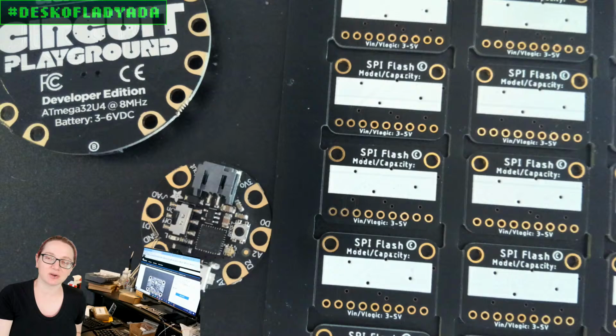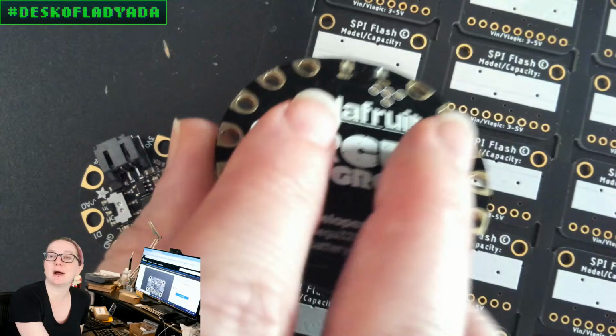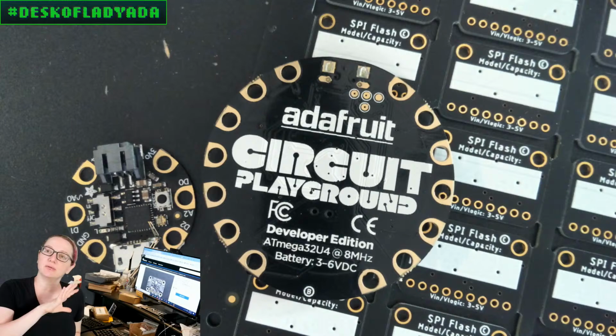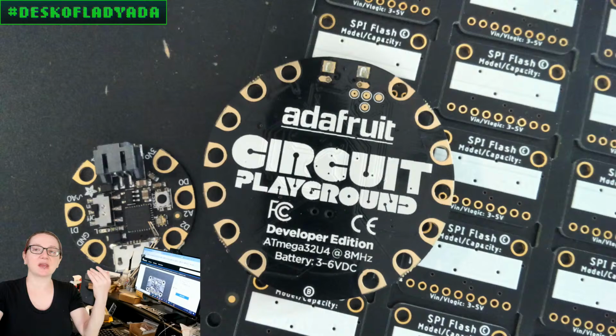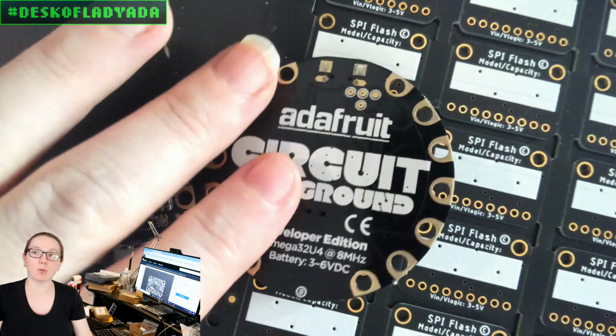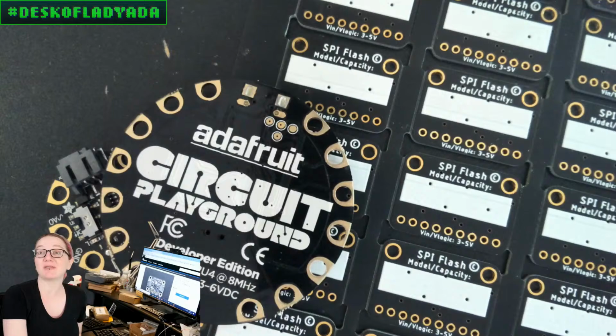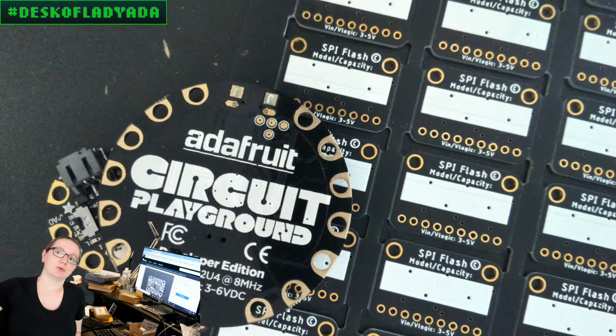And another thing is the way we do these nice silk screens, the Gerber files are exported to, I think, DXFs, imported into Illustrator or some other vector editor. Phil B does the silk screen and then it gets exported back from SVG into BMP. It's basically uneditable. This is one object in EagleCAD, one bitmap object. Again, it's awesome when we do a complicated board, but not awesome when it's just a little breakout or if I have to move the labels around. You can't do that. I'd have to go and edit the SVG and then re-export the whole thing.